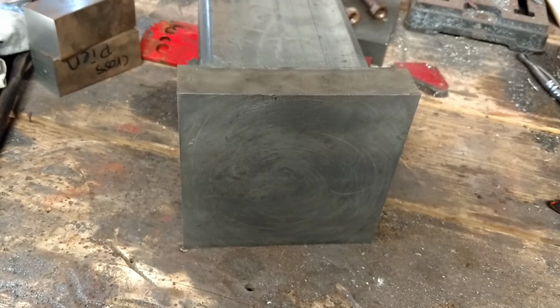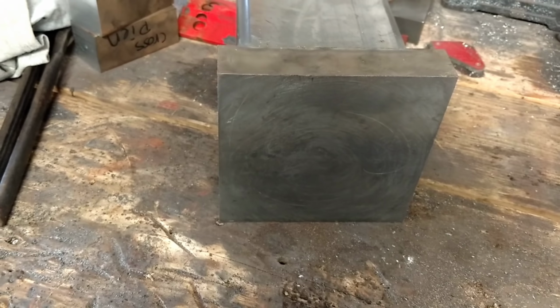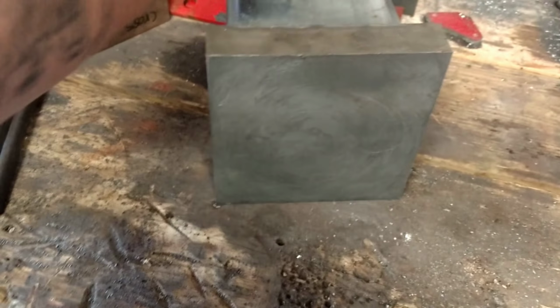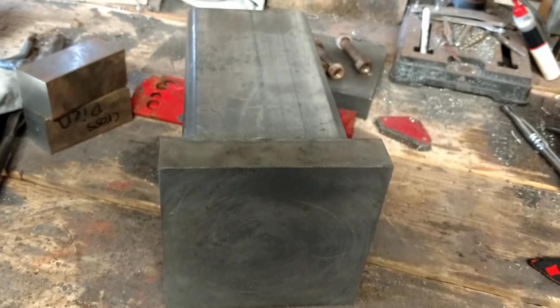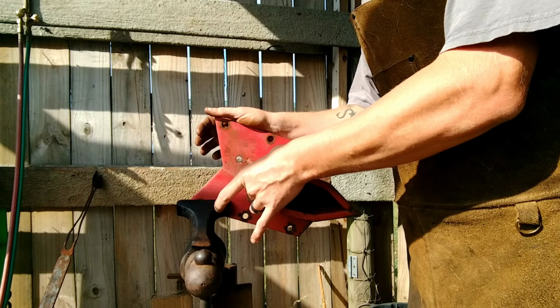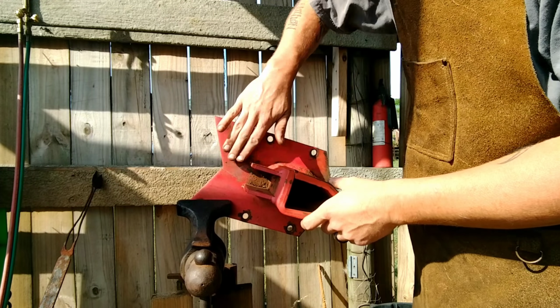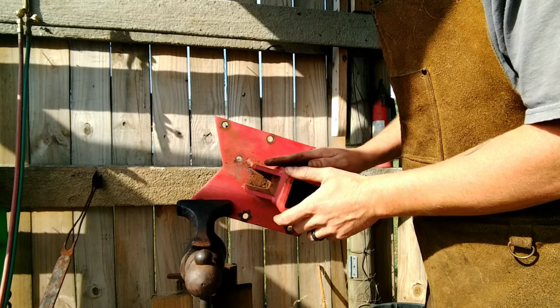on to the guide plate. We got to get that wedge off that guide plate so we can modify that to adapt the top anvil when we make it. Okay. The guide plate rides up and down the beam, the ram's attached to that right there. We need to get this whole piece off of this plate, because we need this plate, but we don't need this. And this is welded on there pretty good.